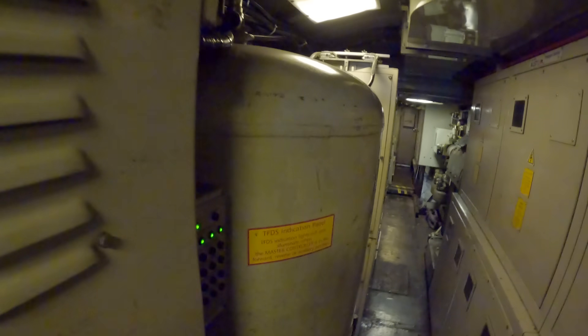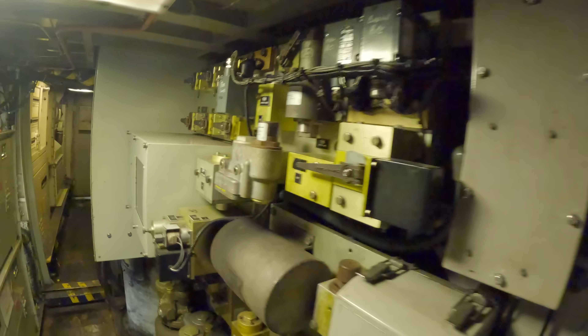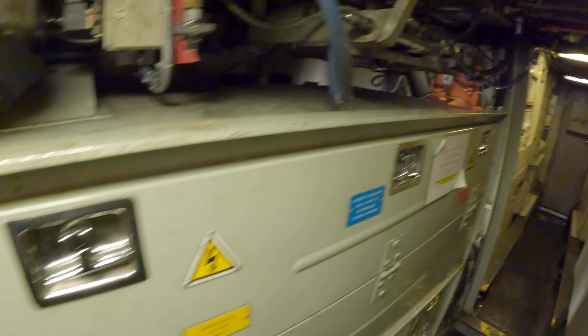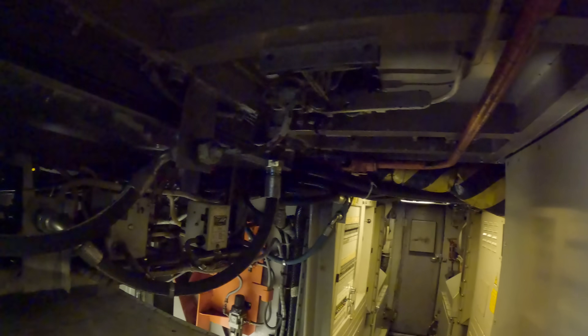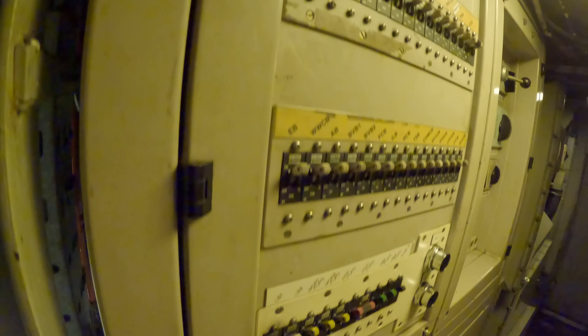This is the TDM panel — that makes sure that the front and the rear are trying to talk to each other. We've got the big main res tank there. The TFDS panel there, making sure the lights are in green. Coming down now towards the brake frame, we've got all the different brake cocks there — E70 and then the bogey brake cocks. This is the battery box and then we've got all the stuff for the pantograph. This is the control cupboard — we make sure the circuit breakers are in, nothing's tripped, all the lights are green. This is the parking brake; we can see the indication there, this is the true indication and the one in the cab is like a relay of that.